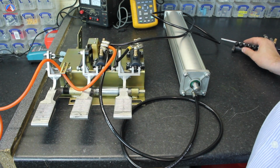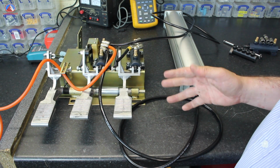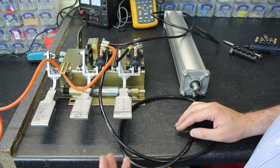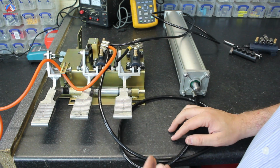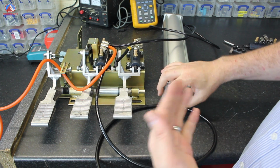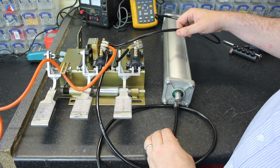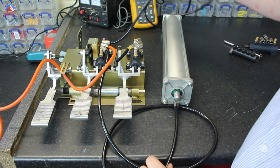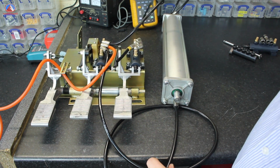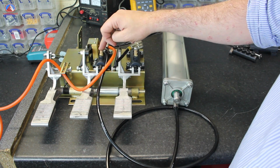And it's very important. Sometimes you think, oh, I have plenty of pressure on this machine. I have 110 psi or 10 bar. My rams aren't working. I'm getting a supply. You disconnect here, say, and you think, yeah, plenty of supply there. It could be a return. The return could be the problem. So if we were to put air down this pipe, you'd expect this ram to push out, but this has to exhaust back out through this.